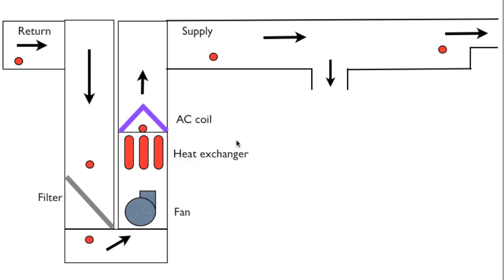These are very low pressures, but it doesn't take a high pressure to move quite a bit of air. Now, there are three parts to any of these ductwork systems we're dealing with. There's a return air here — this is air coming back to the air handler, which is right here, from the conditioned space.